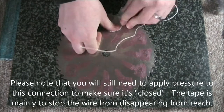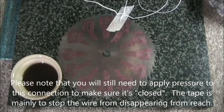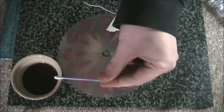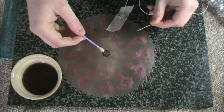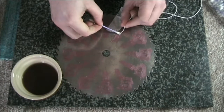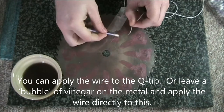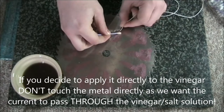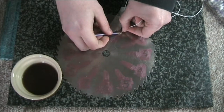Take your vinegar solution — two parts vinegar to one part salt, or add salt until you're happy with it — and take your q-tip, dip it in the vinegar, put it where you want to etch, then add the wire. You may even hear it sizzling, especially if you're using a transformer. Hold that there for around about a minute per line.